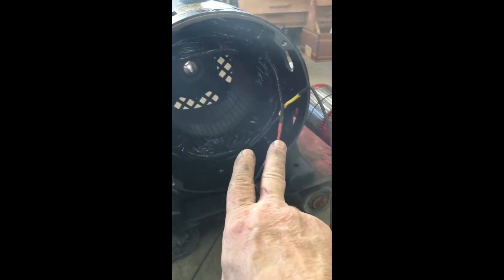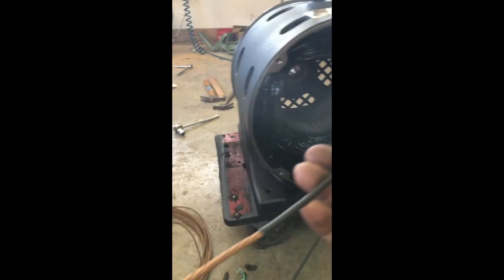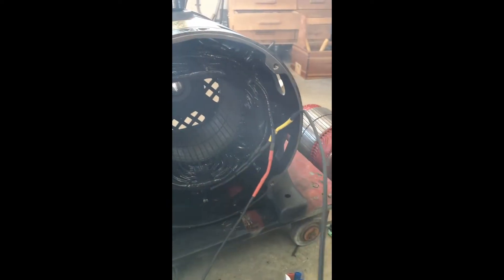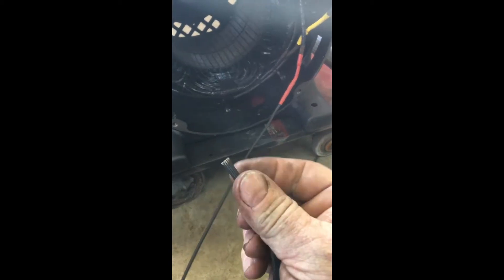Good afternoon guys — just tidying up the leads coming off the motor. It's a four-lead motor, 120/240, depending on the configurations of the wire. I decided to bury the connection into the pecker head here with shrink wrap — this is all cloth wire — and then extend the leads out to the disconnect. It's still a dual voltage motor. It's number eight wire for the leads because it's 52 amps at 110V. Thanks to somebody for recommending this sheathing as an insulator — it's fiberglass.